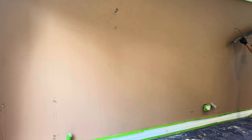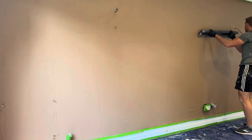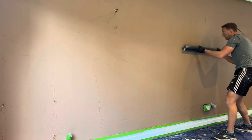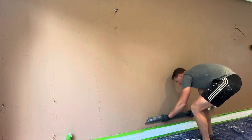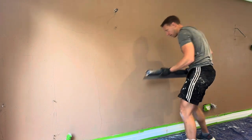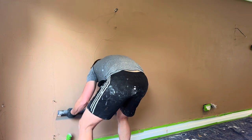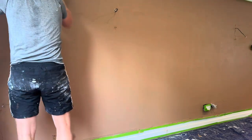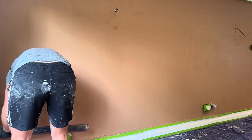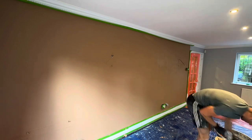On this particular wall it's taken over 20 minutes — it's autumn so it's not particularly warm. I'm just finishing the flatten now, and once that's done I'll mix up a fresh coat of plaster for the second coat, which I'll apply the same way as the first. You'll also notice I'm having to go around some wires in the middle of the wall — those are the wall lights for the lounge. The customer has the screws in place ready to go, and the four screws in the corner are for the original radiator, which they've specifically asked me to keep.